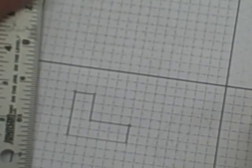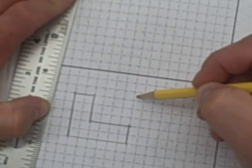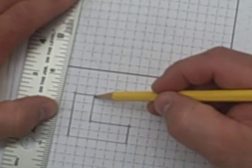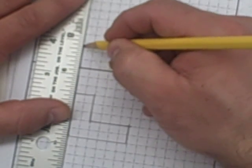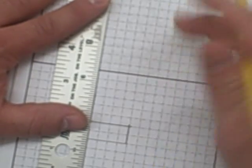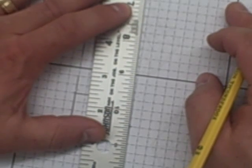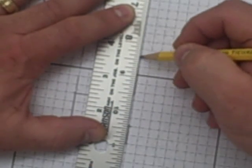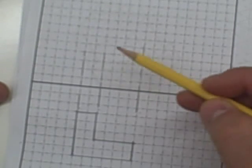Now I'm going to start by drawing projection lines, as we read in our notes. They show where an object starts, where it ends, and where there are any distinctive changes like this corner right here. So I'm going to make a very light line up into the top view square. Dark enough where I can see it, but not as dark as our object lines. And here shows me where the object is going to end. By using these projection lines, I know where the object starts, where that step down is, and where it ends.